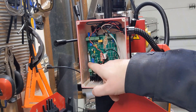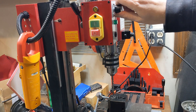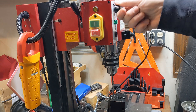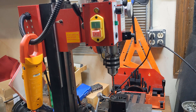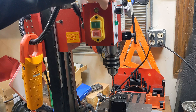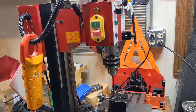I've already turned that pot here an eighth of a turn, so we're going to give it a try. Well, I'd say that's no better because now it doesn't move at all. There's an even bigger frustration - it was not working. Turn it on and off, on and off, nothing. So then I moved some wires to attach the ground clip and it started working. I didn't disconnect any, I didn't tighten any screws - I just moved some wires. It feels like maybe one of those terminal blocks is not soldered in properly, or it's got broken solder.